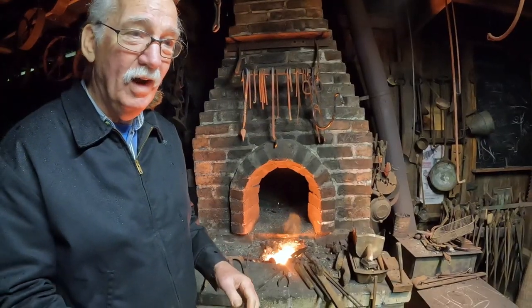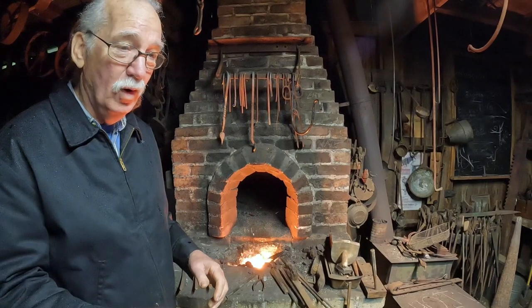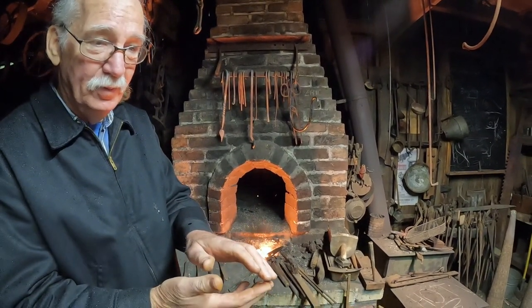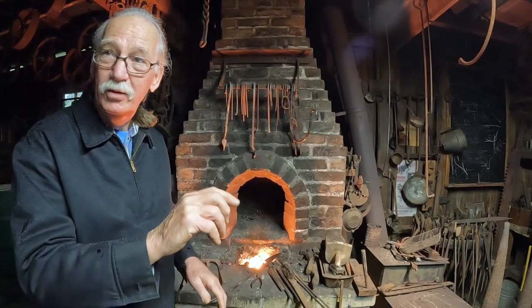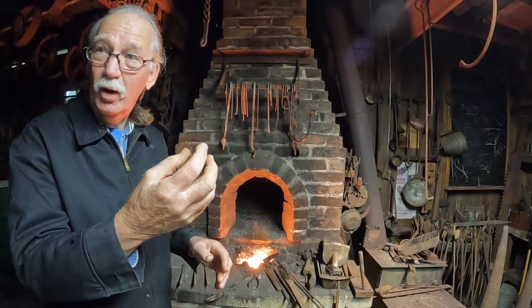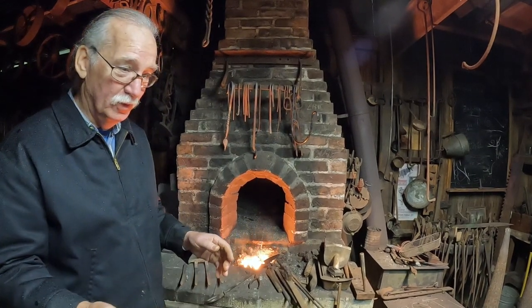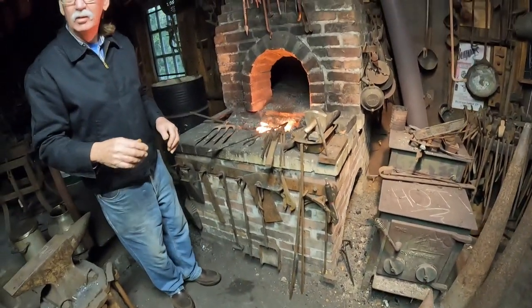When they produced the wrought iron, the only way to get the impurities out of it was to continually heat it and run it through a big set of rollers and squeeze out all the glass and melted sand and other impurities. That's just all the basics. Iron is iron melted right out of the ore, with no ingredients added. Carbon steel is taking that wrought iron in fairly flat sheets, putting it in an oven, and putting powdered charcoal between each layer and baking it for about a week. And the pores open up and absorb the carbon from the charcoal, and you have all of a sudden a real hard steel instead of a soft, pliable, easy to bend metal like iron. Oh, okay.